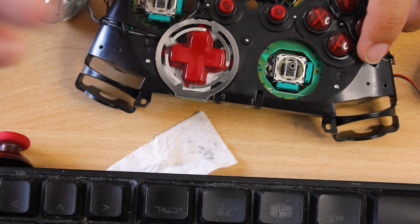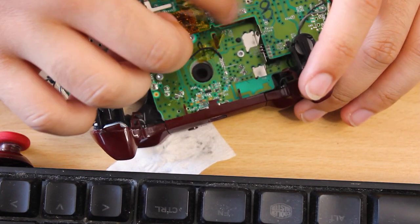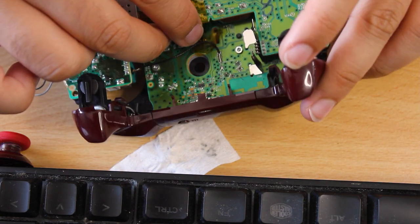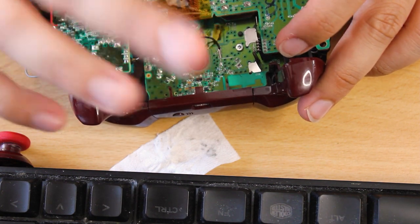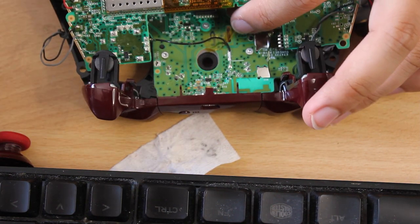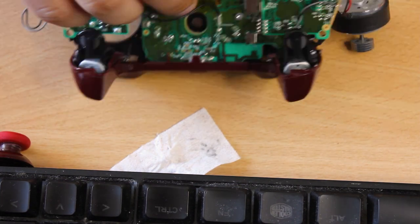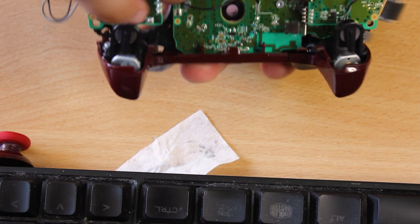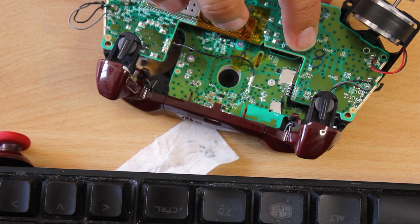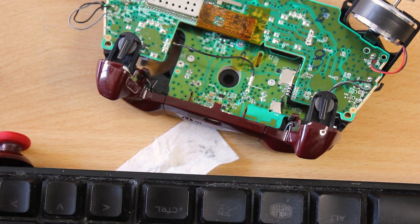I went through a couple of my camera batteries. What I'm going to do is re-solder everything. Looks like I broke a trace on it — right here. It kills a bit of the trace but it still connects, so it's fine. I'll just put a big blob of solder on it. For now I'll put this little housing back in.